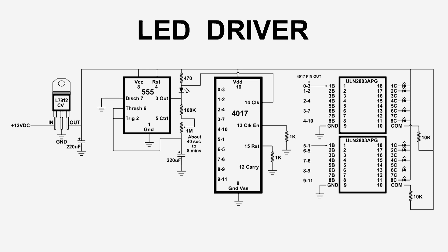The next chip over is the 4017, which is the decade counter. The 555 timer clocks the decade counter, and it goes from 0 to 9. The inner numbers are the pin numbers associated with 0 to 9, and obviously they're not in order.